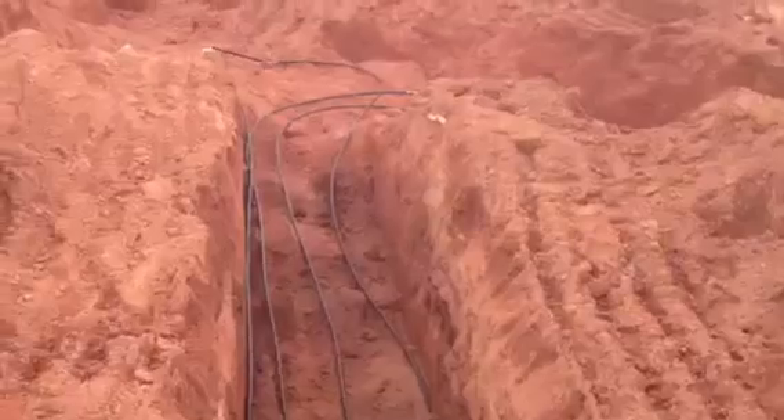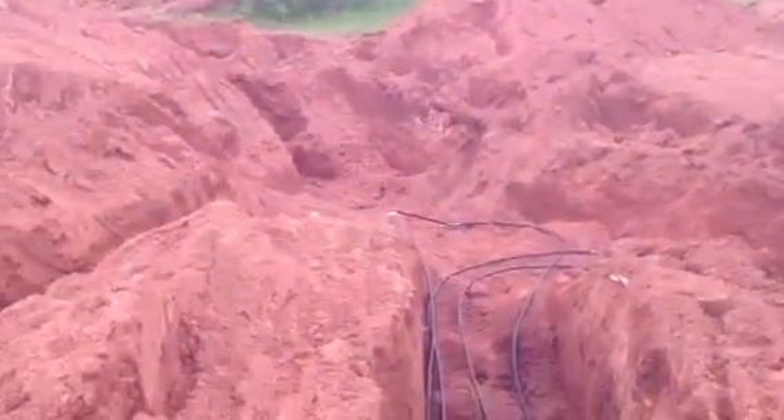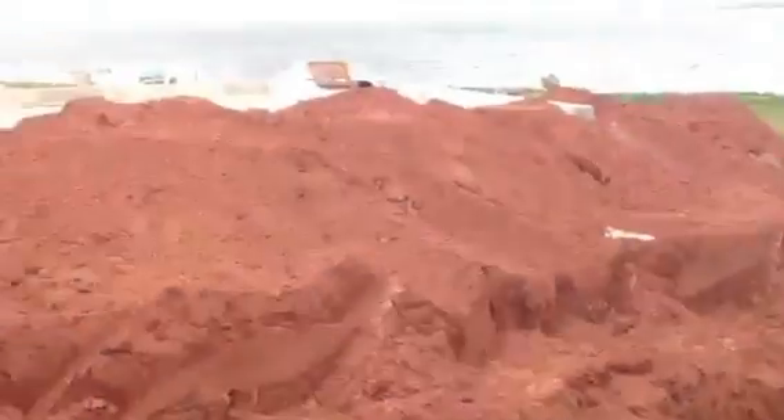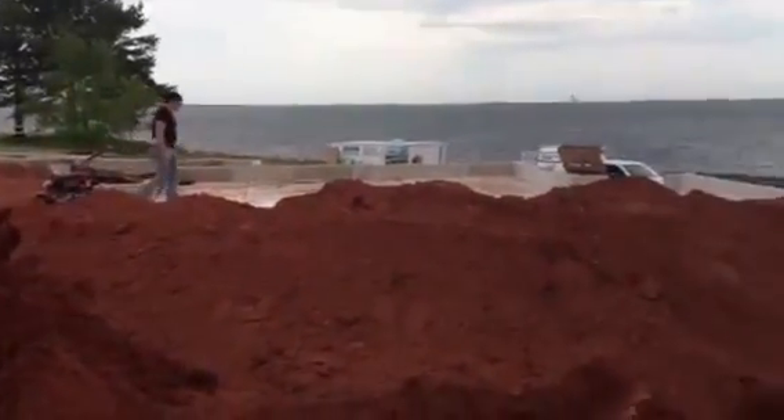This is a polyethylene pipe, HDPE pipe in the ground here. We lay about 600 feet of pipe per tonne. This house here is three tonne. Beautiful area. It's a geothermal unit — it's a full meal deal.